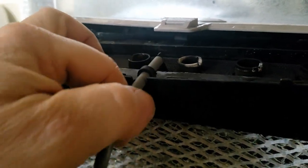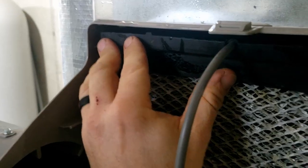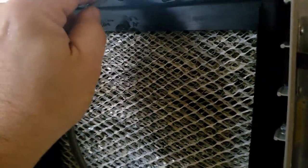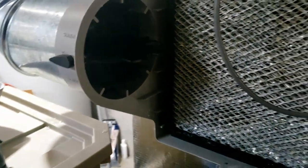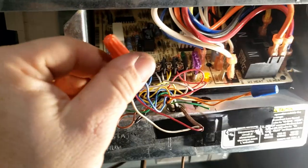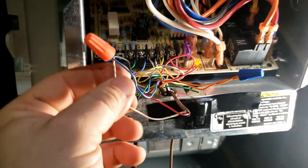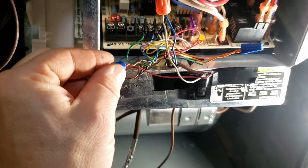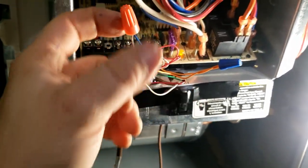We went ahead and unhooked this - got it wired directly down to it. This is one of the biggest things I see wrong usually. It's supposed to come straight in, hit that, and make sure this locks in like that. Make sure that thing stays as level as possible so it doesn't trail back out. Everything wired upstairs looks correct. I got a common wire sharing to the humidifier, to the outside unit, and then down to the thermostat. Here's the humidifier on brown heading up there on the two wire. Everything seems to be correct.